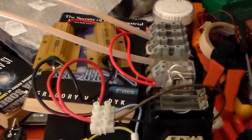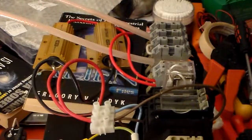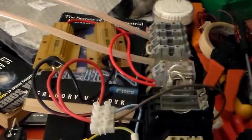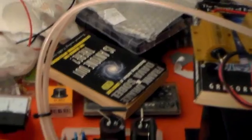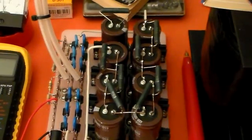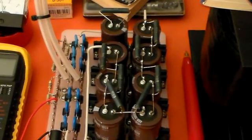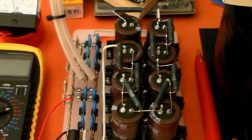I'll just show you what I've got in mind. These resistors don't even get slightly warm - they're 3.3 ohm, 100 watt resistors and they seem absolutely perfect for the job. I was originally going to use the DC soft start circuit, but I've changed my mind. I'm going to keep it as simple as possible. I'll just show you quickly what the circuit diagram will be. I haven't changed the HT board yet - I've ordered some bits and pieces for that. That's probably going to be something for the weekend, but I fully expect the HT board and the soft start to be finished this weekend, which means the power supply is pretty much finished.